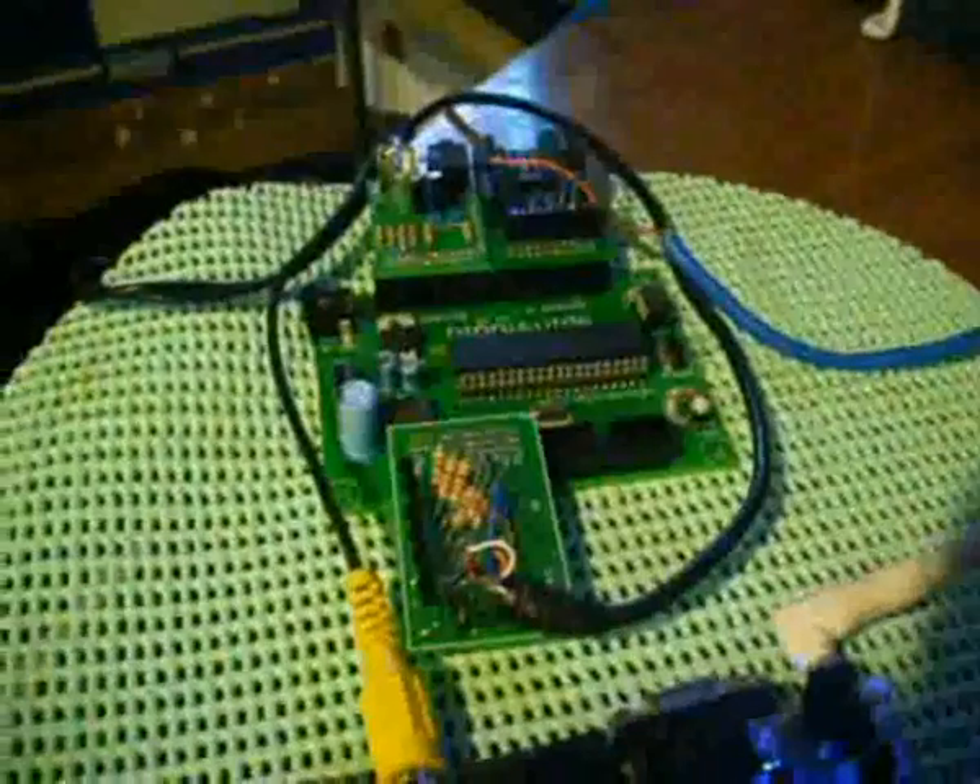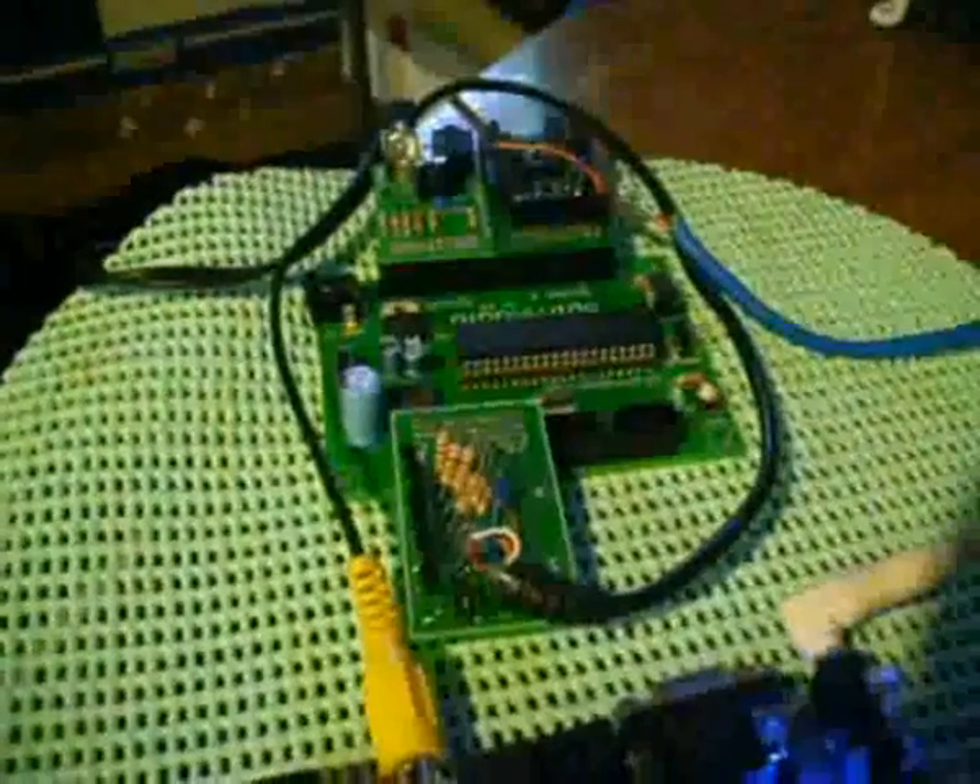While the program is loading, I want to show you the second propeller. The second propeller will be working as the joystick controller. This is a U-controller Spin Studio board, which allows me to plug in modules very quickly into the propeller — a nice way to develop hardware. The module right in front of you is our joystick module, where the propeller is controlling up, down, right, left, and fire of the joystick. That black cable is going over to joystick port 2 on the Commodore 128.